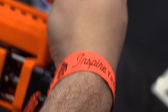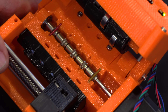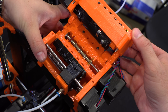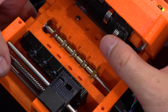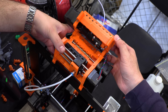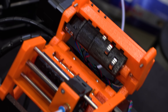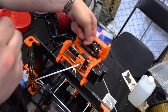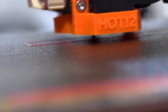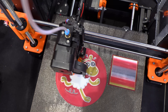Here you can see that we have five drive pulleys, which are standard from the Mk2, and when you select the filament, the motor is engaged. You can see the barrel with idlers, and that selects the filament which will feed. Also, when the filament fails to load into the main extruder, there is a small blade, and it can retract the material — for example with a blob at the end — retract it back and cut the end. It's just as if you would be switching the filament in the extruder by hand. It's automating more of the manual process of doing multi-material.